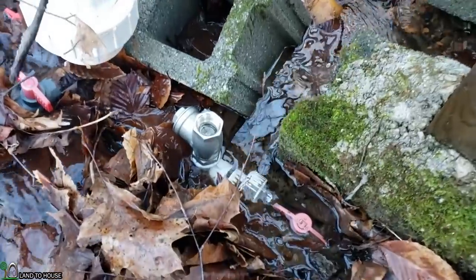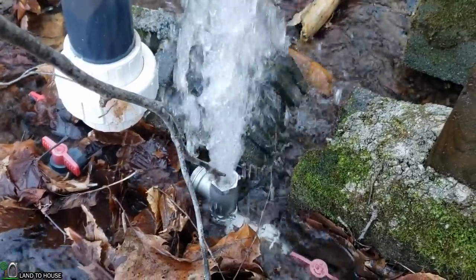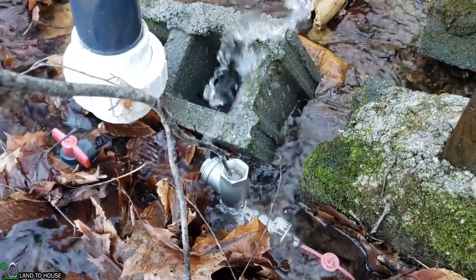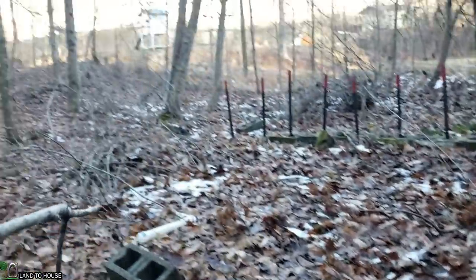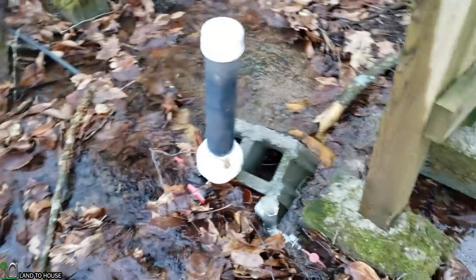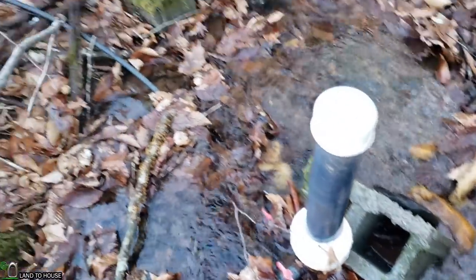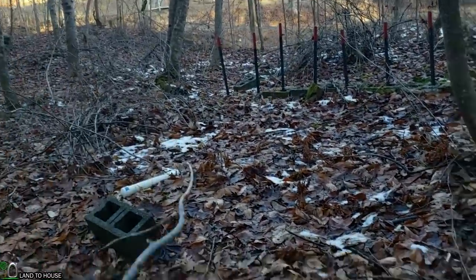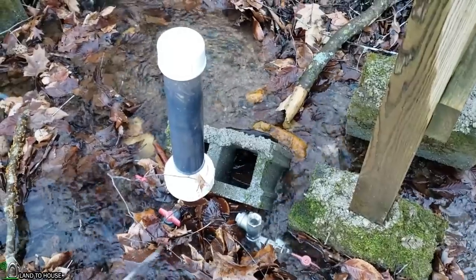I'm back out here the next day. It's a lot warmer and this should be able to start now. Looks like the valve has closed on its own, so I need to hold this down to make sure there's no air bubbles in here. This will cycle on its own — the pressure wave when this closes is pushed into here, which builds pressure in the tank and then sends water up the pipe uphill to way past the house up there. Water will come back down the pipe and basically needs to be reprimed — water is being pushed back up this pipe until there's enough back pressure to keep it going. We'll go up to the top and see the water flowing out, and we will hopefully see this thing run for several days here in the cold.